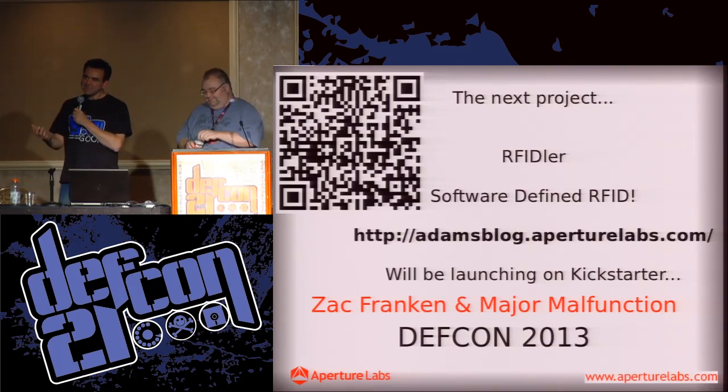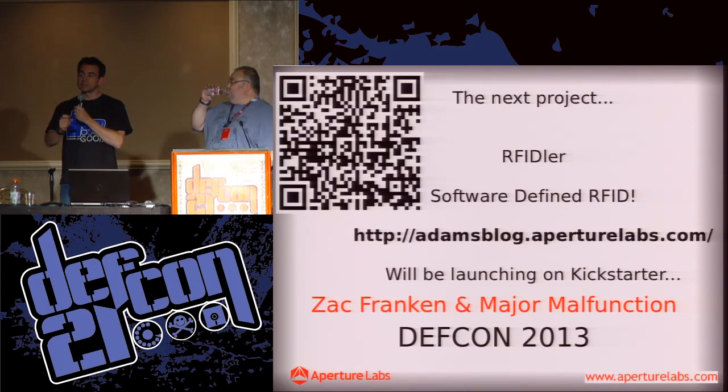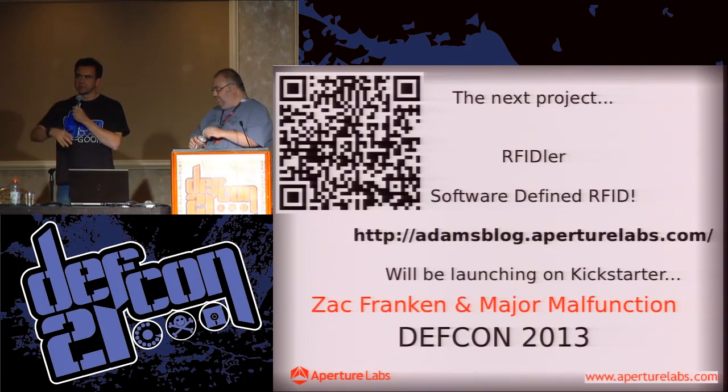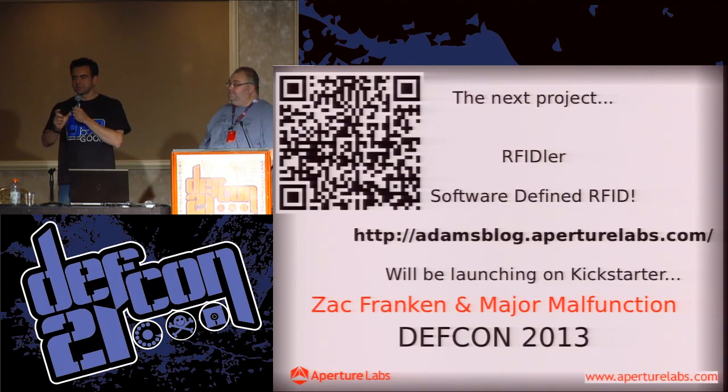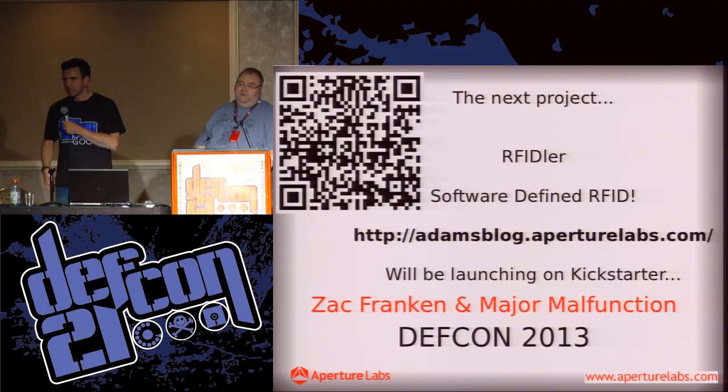But the checksum is actually two checksums. The left-hand byte is a left-hand checksum, and the right-hand byte is a right-hand checksum. And they just do a slightly funny wandering algorithm that would definitely go wrong. It's just there as an assurance to make sure that the code runs correctly. They'll have a test routine that will run through and read the ROM before they blow the fuse, calculate the checksum, and make sure it matches. So it's not going to try and recover any lost bits. It will just say yay or nay. Yeah, and the fuse is there only to disable the test routines for the chip.